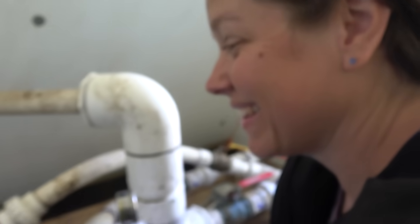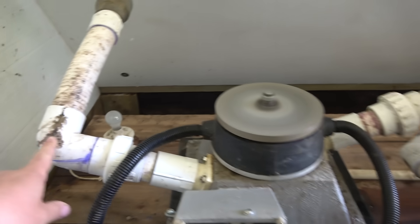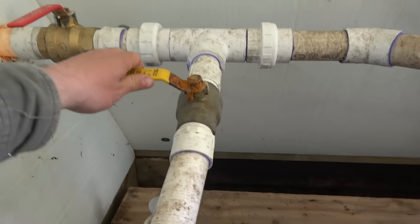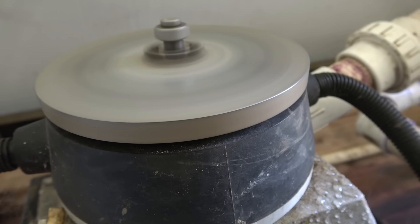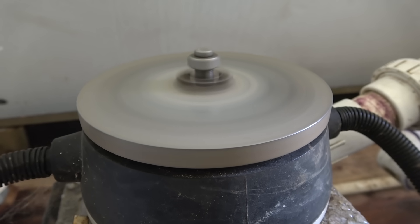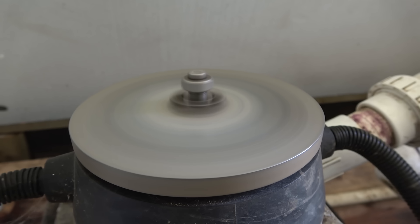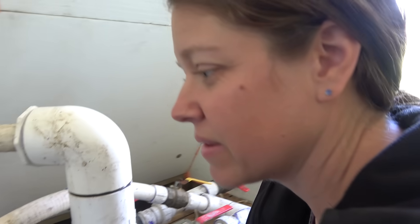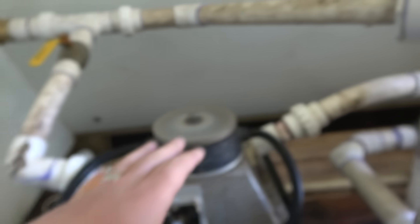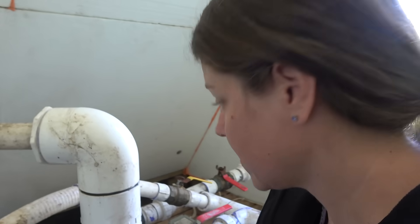It's like a really fast potter's wheel right now. It's got two nozzles, but you don't need to have them both turned on — in fact one is turned off right now. When you open the second nozzle it speeds up, though it kind of slows initially because opening the nozzle reduces pressure while increasing flow, so it's not a perfect balance. Either way, with both nozzles open it's now producing about 1300 to 1400 watts, continuous, non-stop, 24/7.